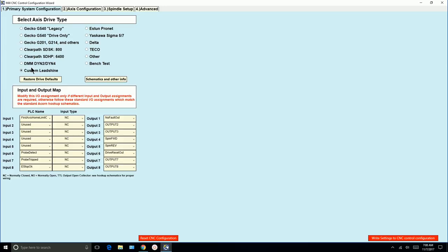When at all possible, try and follow the schematic when you do your bench test. You can wire limit switches up and manually turn them on and off during a bench test. Some other items like not having a spindle drive won't hurt to leave. Just know that when you make changes here it's going to change to custom, meaning you're deviating from the schematic that Centroid provided.